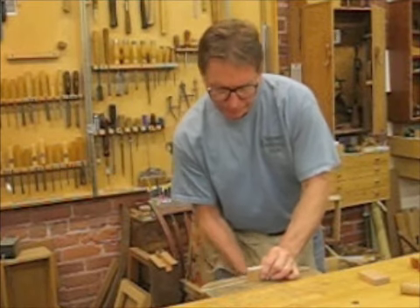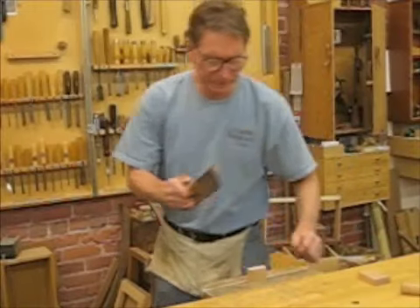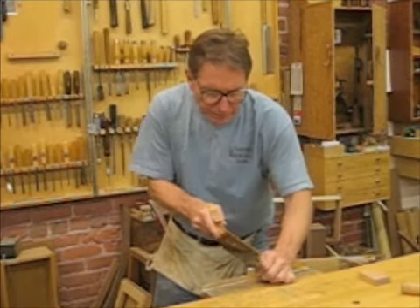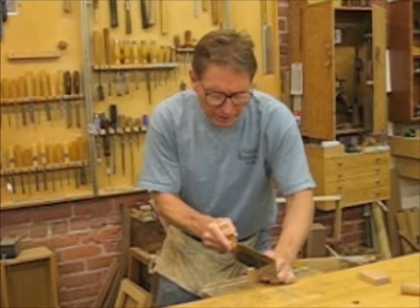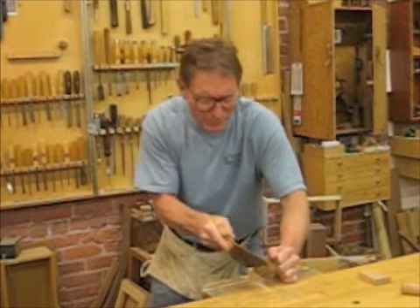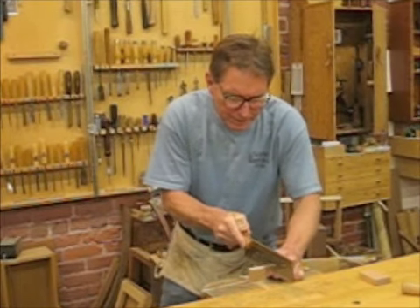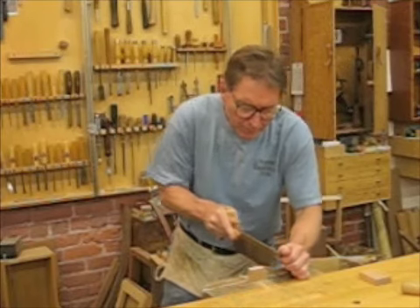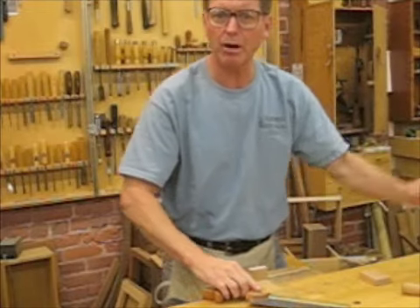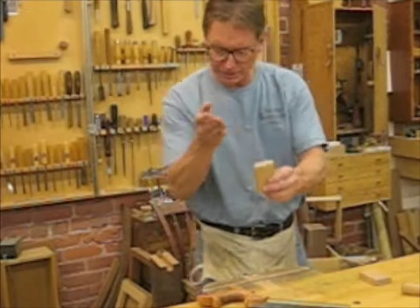Put the board in the vise, nice and straight. Start a cut on the reverse stroke. Lay a line across the end grain and then tip the saw over to about 81 and a half degrees — not too much, not too little. Get the same cut started on the other side. It doesn't matter exactly what angle this is cut at, because whatever happens here, you're going to mark out onto the other piece. Get your two cuts made straight across at your angle.